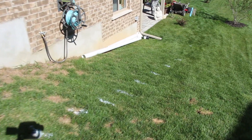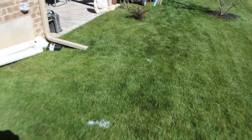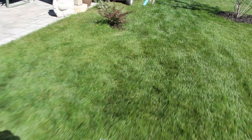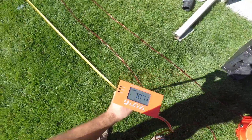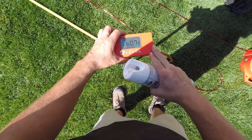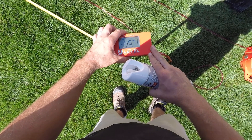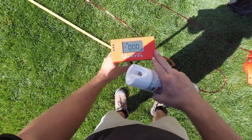We need to mark where each of our steps are going to be, and we're going to use the high precision altimeter to do that again. We'll go back to our zero point — our end final step at ground level — and measure up 6 and 3 quarters of an inch. Essentially the slope is going to dictate where each of our step-ups are going to be.